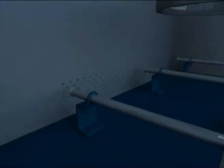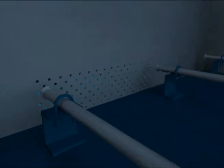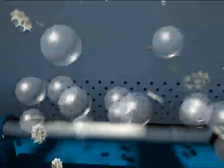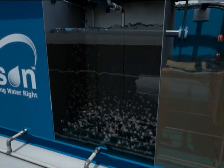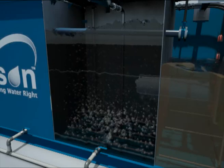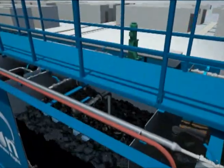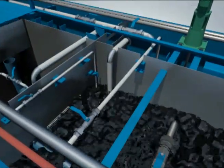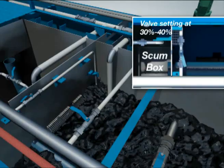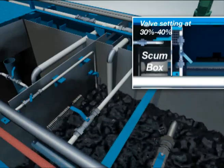The wastewater then flows to the aeration tank. The aeration tank and anoxic tank are connected through a perforated opening at the bottom and middle of the wall between them. This perforated opening retains the plastic media in the aeration tank. The aeration tank is the heart of the biological process, where BOD removal and nitrification — conversion of ammonia to nitrate — takes place. Mixed liquor is continuously recycled back to the anoxic tank with the help of an airlift, and the flow can be controlled by adjusting the air supply valve.